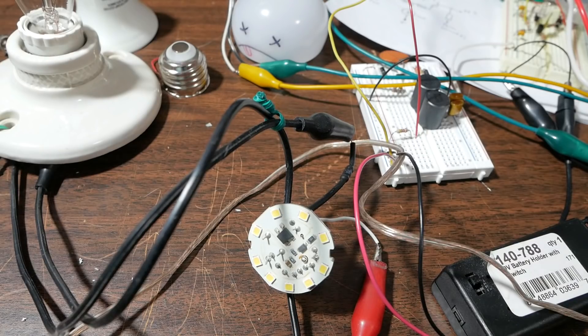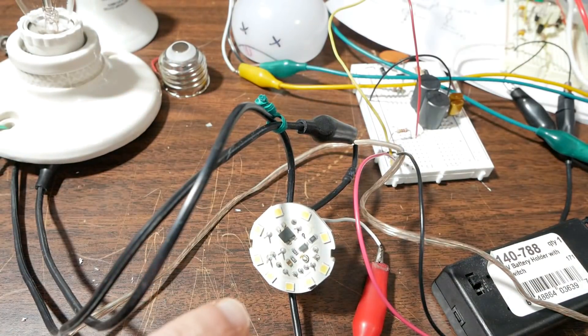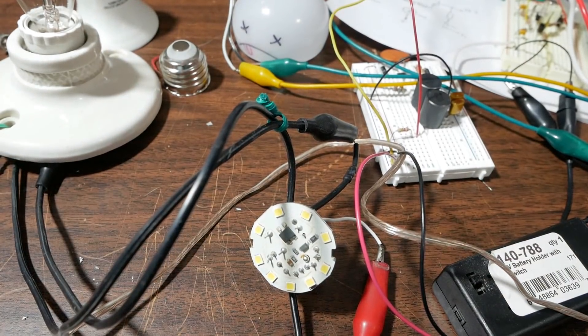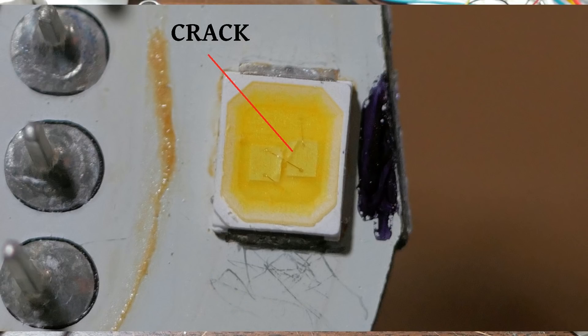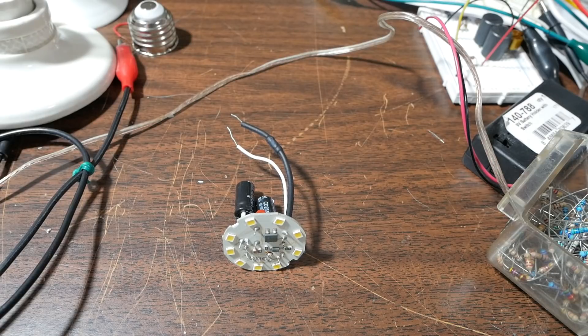I saw something interesting when I looked with my close-up magnifier. I'll put this macro lens on the camera and see if I can get a close-up photo of that LED. It looks like the die on the right has a crack in it in that one corner there. Without closer inspection, you can't see if that crack curves under the bond wire and has broken the connection. I have examined all the other LEDs on the board and they look fine, so it's possibly just a fluke. Those LEDs otherwise seem like very good quality.